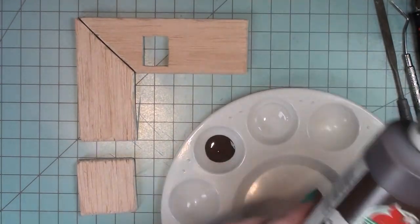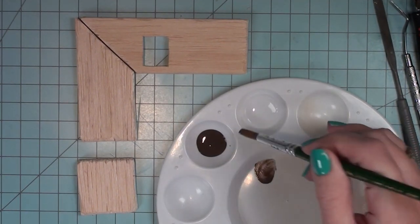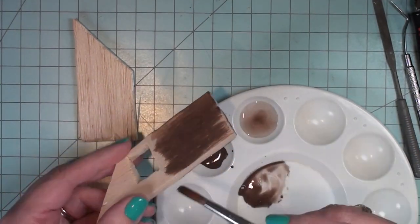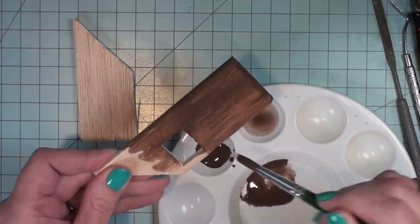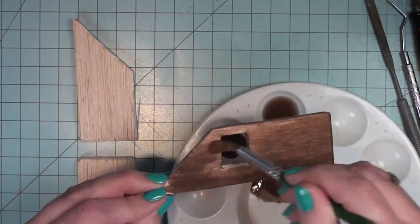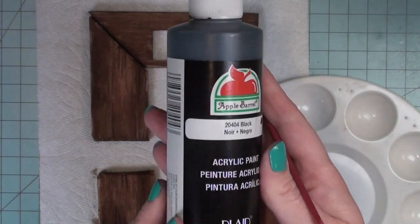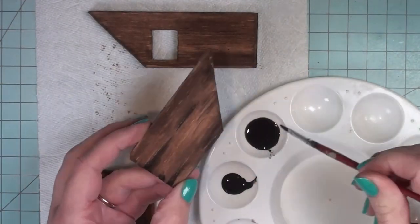Now I'm going to give it a darker look. Because this is a very pine-colored wood, I want to start out by making it look a vibrant brown. I'm mixing a little bit of brown acrylic paint with water, and that's acting as a stain. I used to use actual stain on my projects but found it unnecessary — and I prefer acrylic mixed with water, which also helps with the fumes. Then I'm also going to do the same process but with a little bit of black, getting that black into a lot of the creases I've created to give it more depth in its distressing.